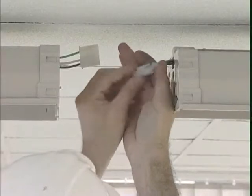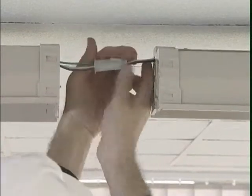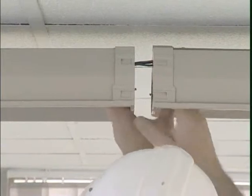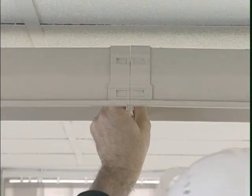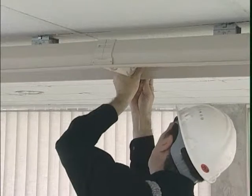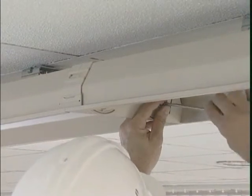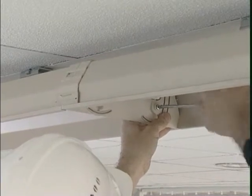Special attention should be placed on the plug and socket connectors of the wiring harness, which should face one another so as to make the connection, and then slide the second luminary toward the first one until their end panels are joined. In this position, the tightening brackets slide into the special spots of the joined end panels. Each end panel bears a factory pre-installed locking screw which is tightened by holding steadily the end plate of the luminary to be connected.